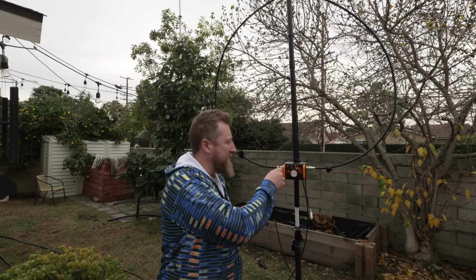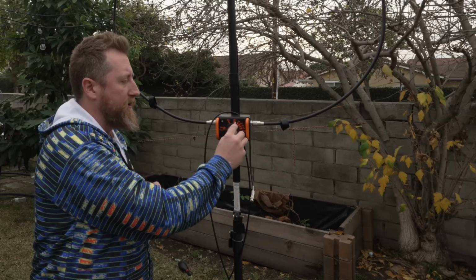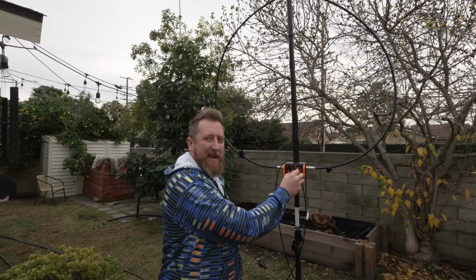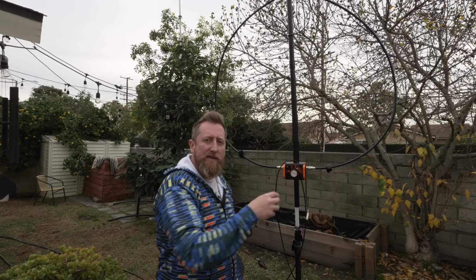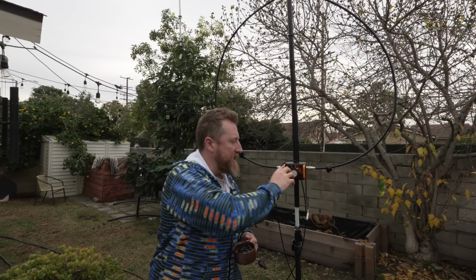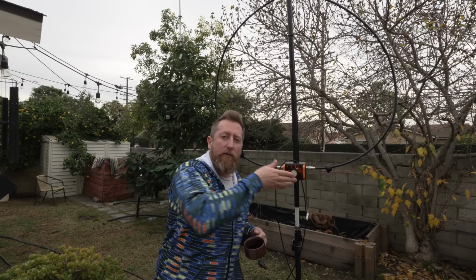The tuning is really nice here with the wheel that spins a lot faster than the arrow, and you kind of just go in there and get it close to where your band edge is, and then use the noise from your radio to kind of get the volume up. That tells you your antenna is kind of at the resonance point for where you're listening, right?